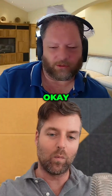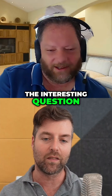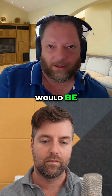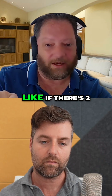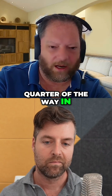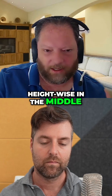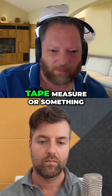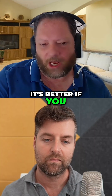It actually is rectangular, but the living room is just a portion of it — it's like a shoebox. So when talking about double bass arrays in a rectangular room, an interesting question is: if there are two subs on each end, you put them a quarter of the way in, in the middle height-wise. You could estimate the delay using a tape measure, though it's better if you measure it.